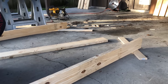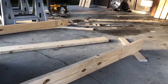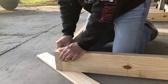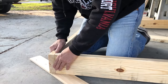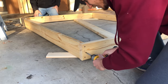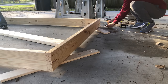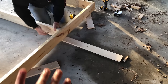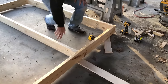We're down here on the concrete, and assembling on concrete is rough because it's often uneven and slopes. What we've done is taken our scrap one-by-fours and laid them below our pieces where we're securing the screws — that gives us more of a level playing field. We're going to go ahead and drive these in and secure it. We've got our frame assembled, and we're using the scrap one-by-fours under our middle stretcher as well.